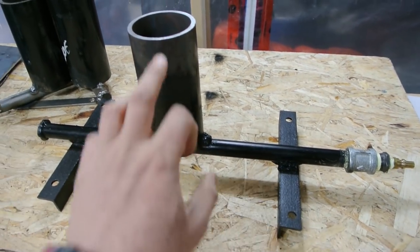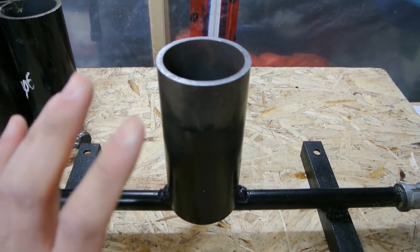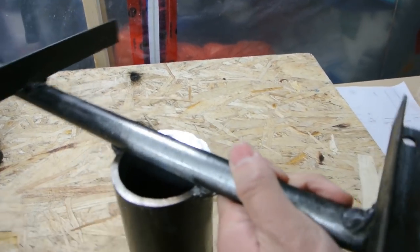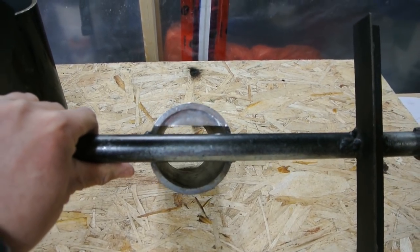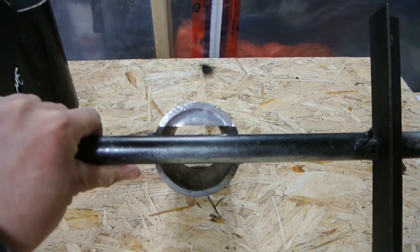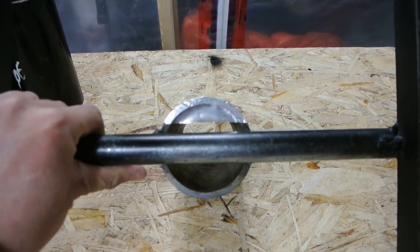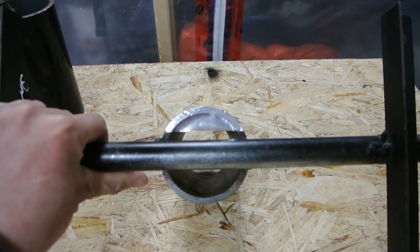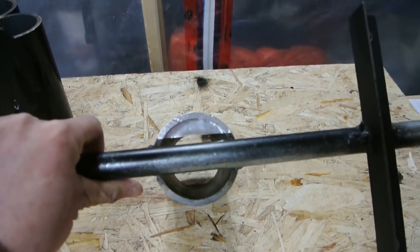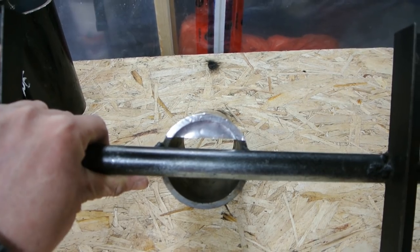All I do is feed propane through it, light it, and it works really well on the power range. The air-to-fuel ratio mixes fairly well — it gets air through the bottom via a venturi effect. However, when I try to get a smaller flame it doesn't work so well because the fuel-air mixture for the propane isn't correct. Propane burns through a very narrow range of fuel-to-air ratio. So I took some aluminum tape and closed off about one quarter of the bottom, and now it seems to burn really well through the whole power range.